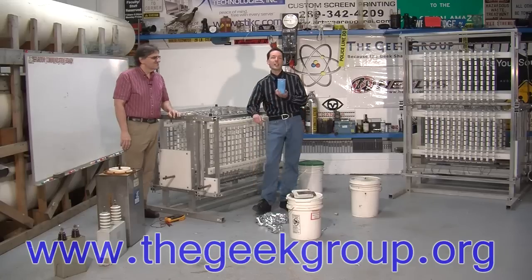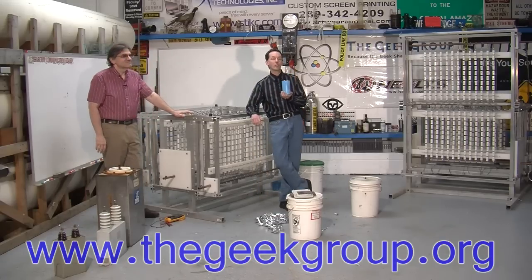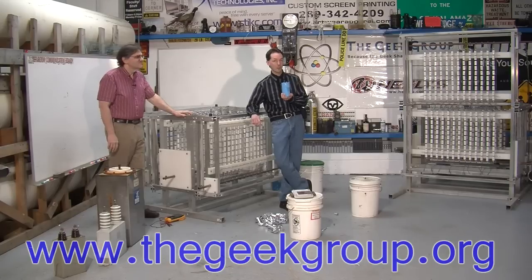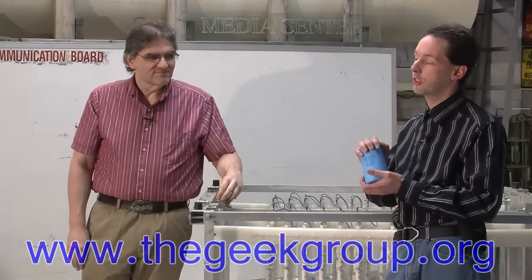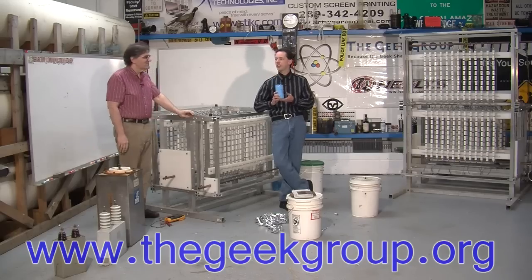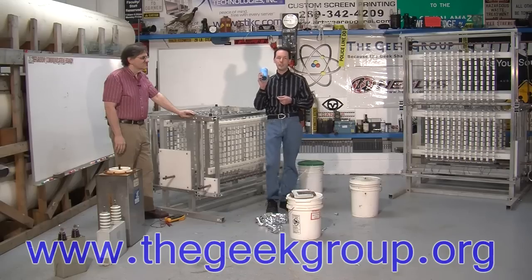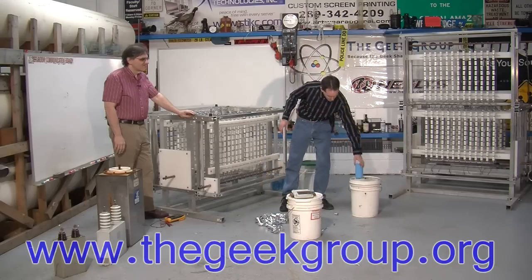This is an electrolytic cap. Absolutely useless in a Tesla coil. It is not pulse rated. We shouldn't be using these for Thumper. They're very dangerous, and it is only a matter of time till we blow one of these up in Thumper. We're still waiting for that to happen, but it's been quite a while. That thing has to have over 5,000 shots on it at least. But if you use this in a Tesla coil, you will make a grenade. You will spew electrolyte and metal and everything. Don't do that.